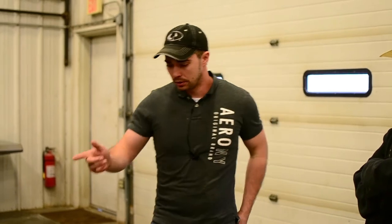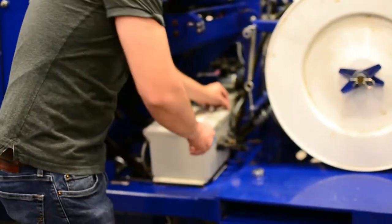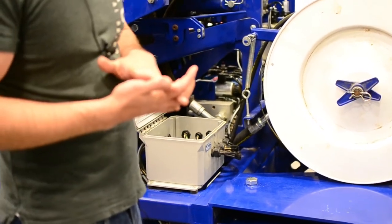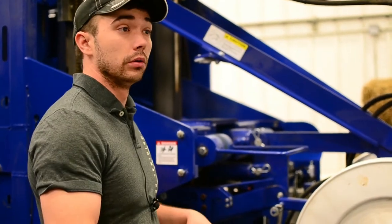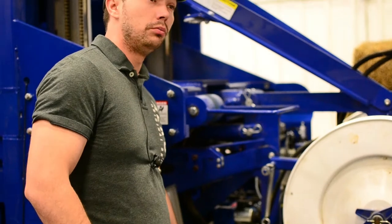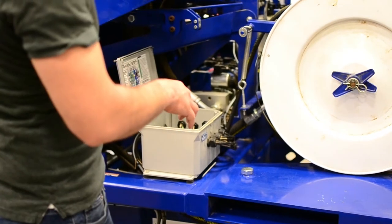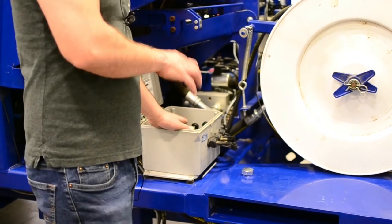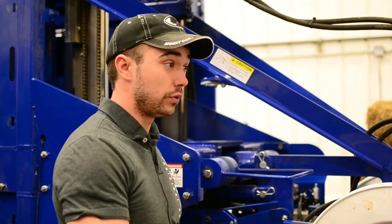Your front electrical box, banding box electrical box, and front electrical box - these boards are identical. The only difference is when we program, we use two different programs: a master and a slave. If a component gets burnt out or we want to isolate an issue, I can tell you to pull this board out, stick it up there, flip a few switches, and that now becomes the slave and this becomes the new master. There are inputs and outputs on each that are not used in the other position.